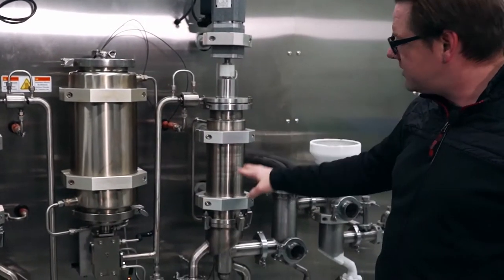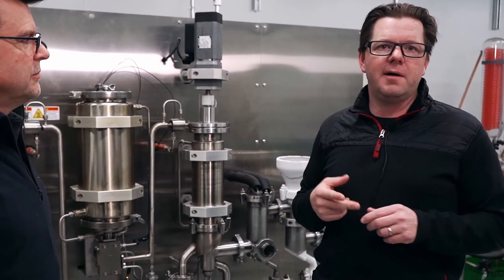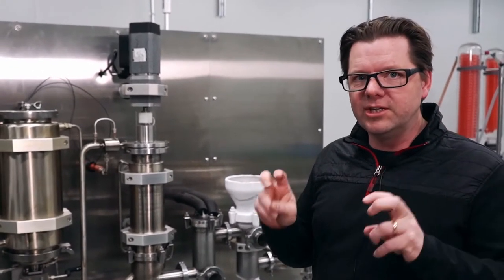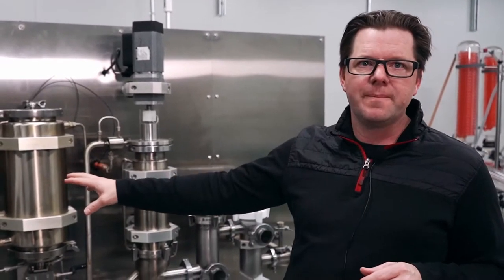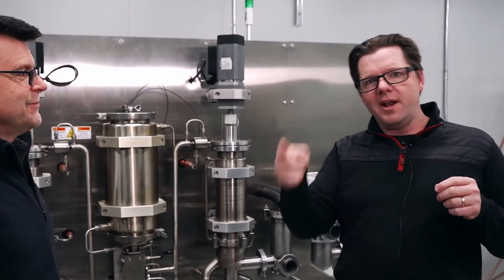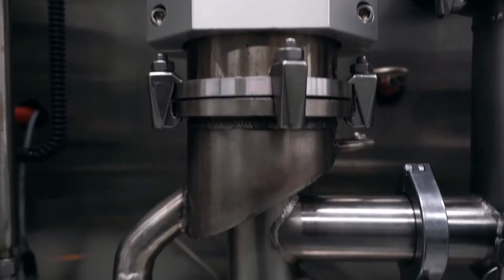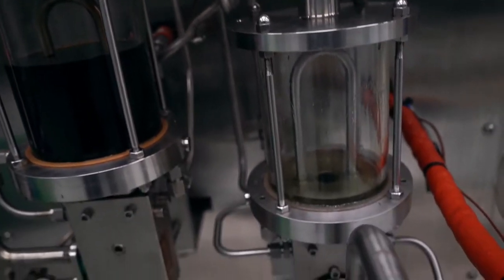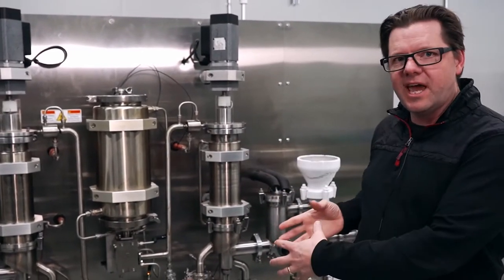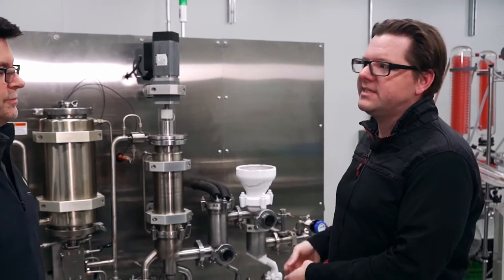From the pump the oil goes into the first wiped film stage. A lot of people distill in two stages: the first removes volatiles, like terpenes, and then the residue from that first stage moves to the second stage — which could be the exact same machine run twice. If you only have one column, you do all the first stage, stop, clean out the system, then start the second stage. The advantage of this unit is that both stages are integrated, so you don't need to manually transfer the residue — it automatically goes over to the second stage.